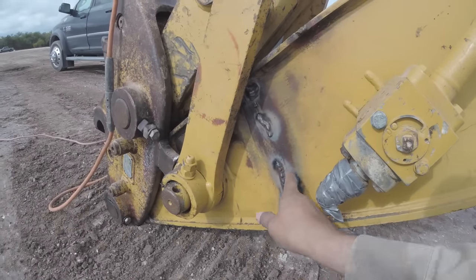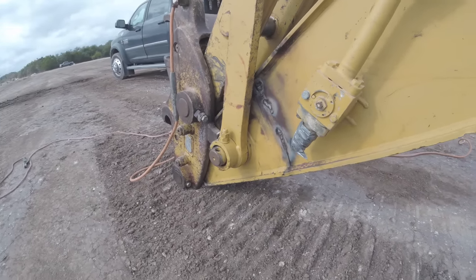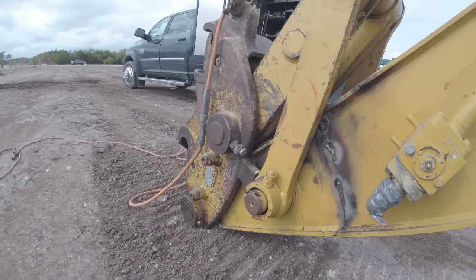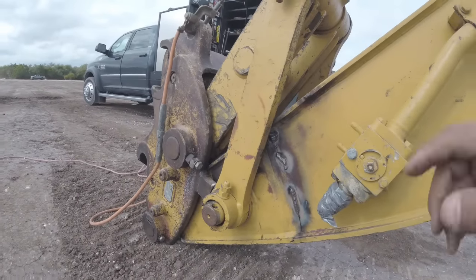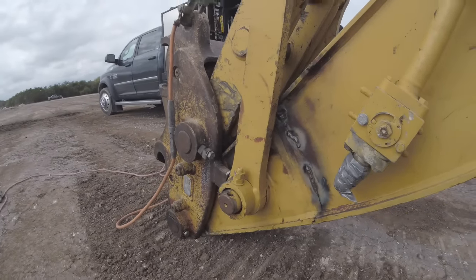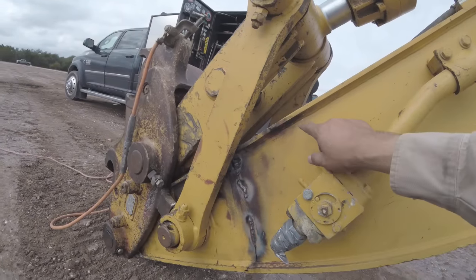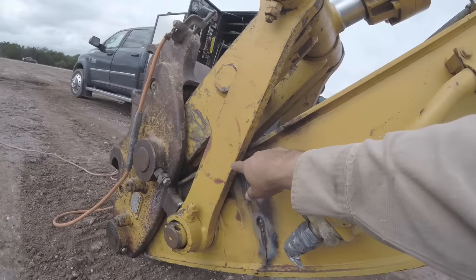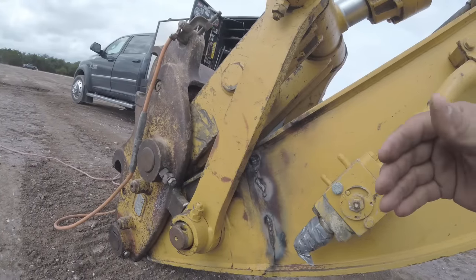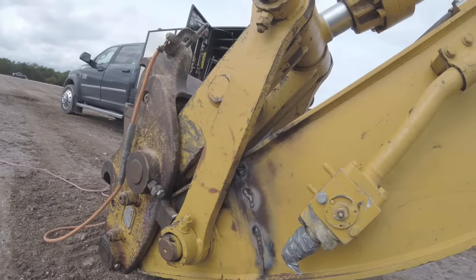But here it worked out pretty well, so I was able to put some stitch welds here and there up on top. And so now it'd be a matter of hopefully that holds while I move the cylinder out of the way and then start removing this quick attach assembly, H-link, dog bones, cylinder. The cylinder can stay. It didn't bend up at all, so good thing for them. So after that, then now what I can do is, being that this is held in place, I'll cut a section of this back about maybe to about right here and go down as far as I can, maybe in this area here. And I'll cut that front face off and see if it's nice and straight and parallel with the boom. Hopefully it's still straight enough that it won't get affected by misalignment.